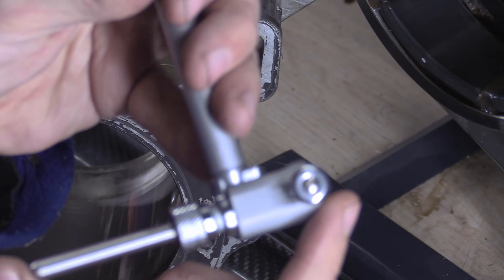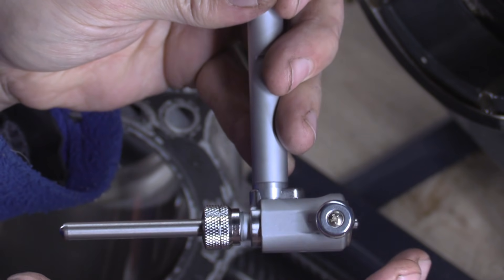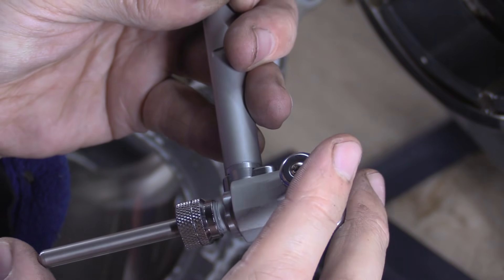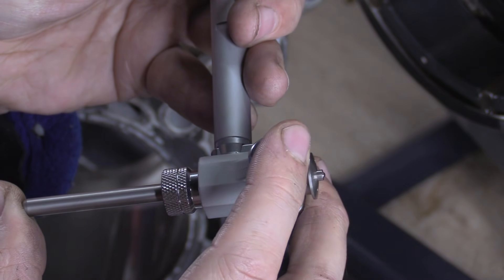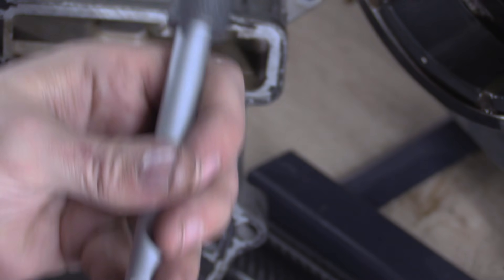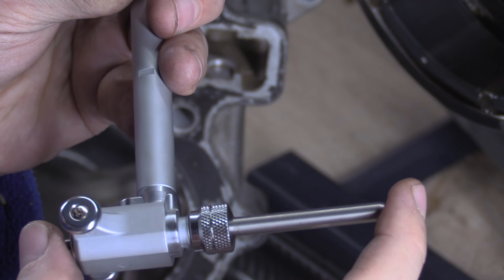On the other side is basically a ball bearing stuck in the end. So you've got three points of contact — two on the wheels following the curved profile, and those are just rounded bits of steel, they don't spin — plus the plunger that touches the wall. If you move the wheels, the gauge doesn't move. It's only when you hit the plunger that you get a measurement.